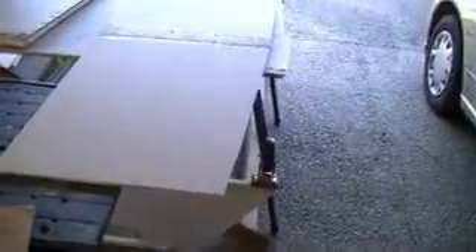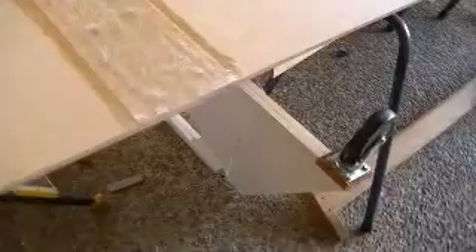This is being made out of MDF as a pattern to make sure I get it right, but the principle is the same when you're putting your kit together. Every attempt is made to have the parts exactly right, but the final finishing of any boat is up to the builder — little bits might have to be faired in and adjusted here and there. There we are, I've just cut that little bit off that was offending the shape of the boat, and you can step back and run your eye along to see that it has a nice fair shape.